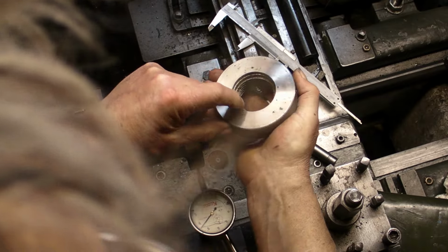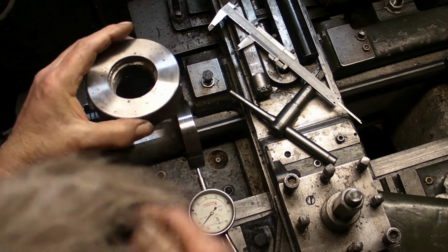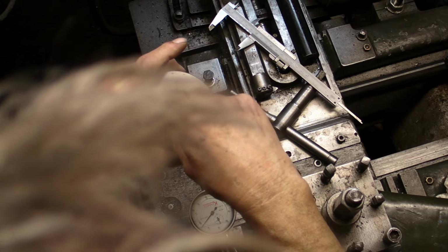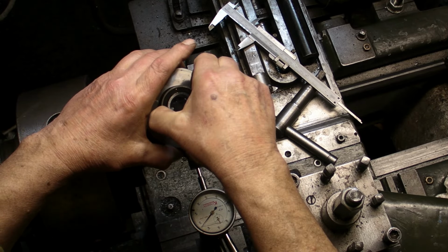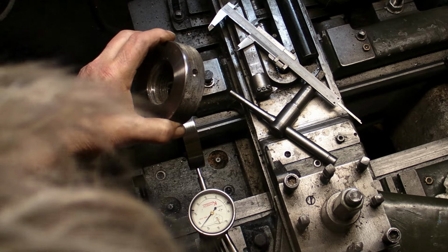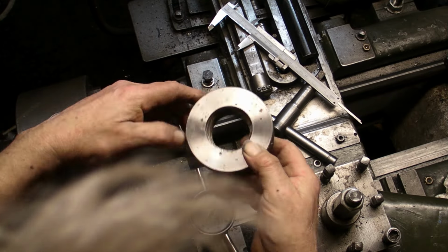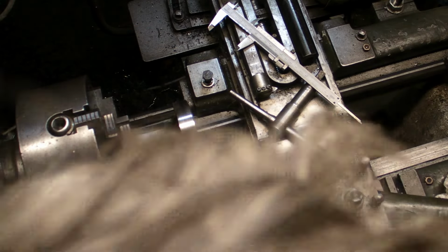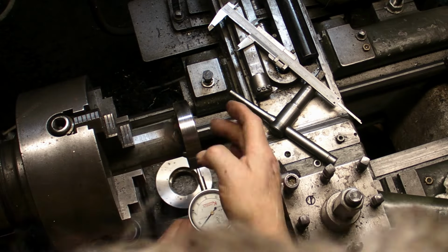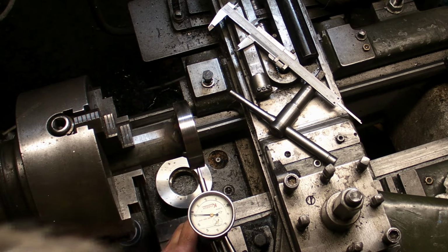I've got another piece here that's just undersized at the moment, and this will then go on the other side, and then that'll take the 47 for the bearing. There's no need for this to be this size. I'm going to reduce it greatly. All this piece is doing is holding the bearing inside, where this one is acting as a register. So that's the job now, guys. Fit the boring bar and take some of that section out.